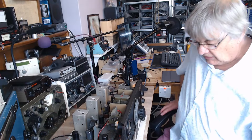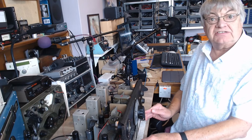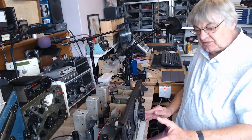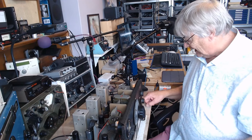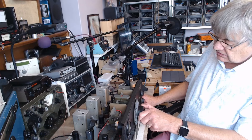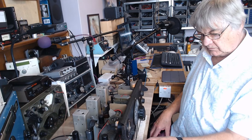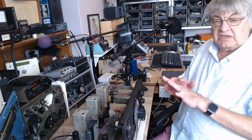More good news — thank you Mike for dropping around another coil pack. It covers 900 kilohertz to 2.05 megahertz, so basically one meg to two megs, which gives me the rest of the medium wave AM band. That gets me Radio on 1458, and I've got LBC on 1152.